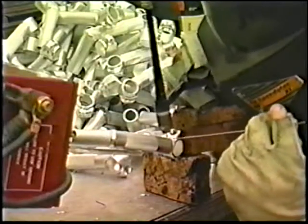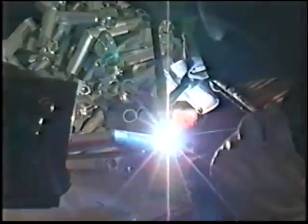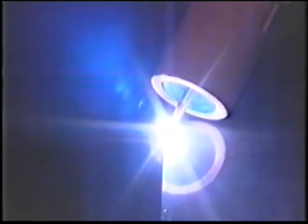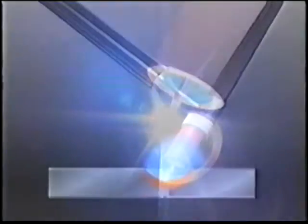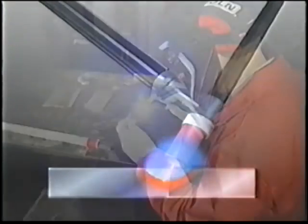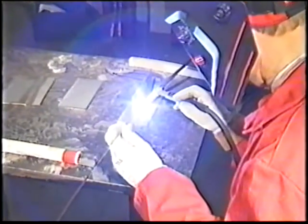To help you be a better welder, it's good to review the basic principles behind the GTAW and SMAW welding processes. The heat for arc welding is created by a special electric arc optimized through a century of experience. With GTAW or TIG welding, the arc is maintained between the tungsten electrode and the base metal. The electrode is not consumed — heat fuses the pieces together. Filler metal is used for horizontal butt welds or with poor fit-up situations.